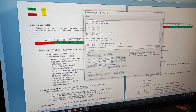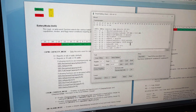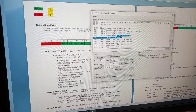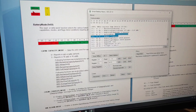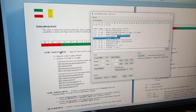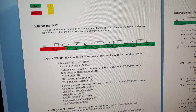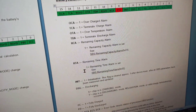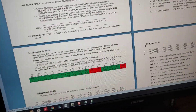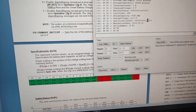Let's dump the register up to 54 — that's all we need. Dump register. Now read the battery mode — showing triple one zero. I put these values into the table: red means high bit, green means low bit. So with one-one-one we can see capacity mode is enabled, charger mode is enabled, and the primary mode is enabled. Going to the battery status — only one bit is enabled here, which is the remaining time alarm. Now the specification info — the last bit and the fourth and fifth bit.